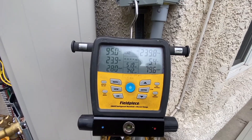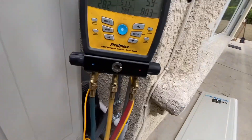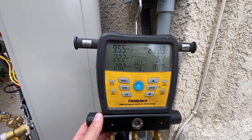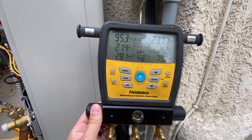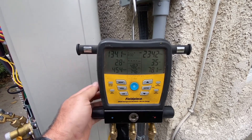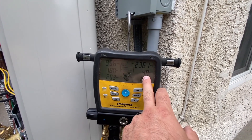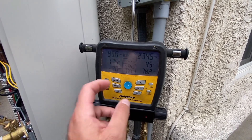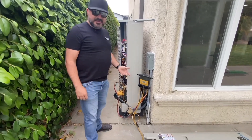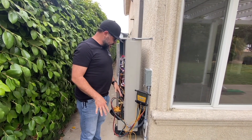The unit's been running for about 30 minutes now. Our subcool keeps bouncing around five to six degrees, so we're just a little low on the refrigerant charge. We'll add a little bit of liquid into the suction line. R32 is a pure refrigerant — it doesn't need to be charged upside down like R-410A, which was a blend. You can charge it as a gas, vapor, or liquid. We're going to do this conventionally through the suction side as a liquid, just a little bit at a time. Watch your pressures; you don't want to go too high. Close it off and let it sit for about 10 minutes to evaluate — the gauges will calculate your subcool for you. You don't need to worry about superheat: in any system with an EEV, an electronic expansion valve will modulate the superheat all on its own. Now that the Daikin Fit system is properly charged — within one degree subcool plus or minus of 10 degrees — we're going to disconnect the tank and gauges from the unit.